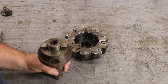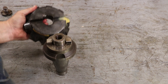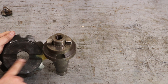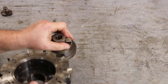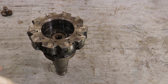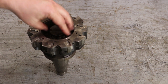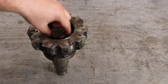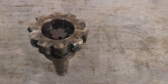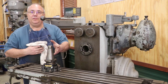These cleaned up real nice over in the parts washer and I think we're ready to go ahead and try to put them together. This is an inch-and-a-half shank, and there are a couple of drive dogs in here that drive this thing. On the back you can see the exact opposite — the inch-and-a-half bore and some slots for those drivers to go into. So this should just come right down over here — it's probably going to be a little tight. Alright, that's right on there. And then there's a nut here that goes down the middle and holds it all together. I'm going to have to figure out something to tighten this with — it looks like that's made for a specific tool. I don't have that specific tool, so I've just got it on here finger tight right now. I'm going to tighten it once we get it onto the mill because I need something to hold it.